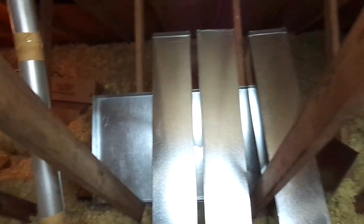Of course our three sections are going down to the small bedroom, and then the auxiliary drain pan goes underneath. We'll spin off of here with some six inch runs, insulate those six inch runs, and then terminate them with no more than seven feet of flex run going to the individual dampers. The codes do not recommend any more than seven feet of flexible duct — whether it's insulated flex or non-insulated flex.